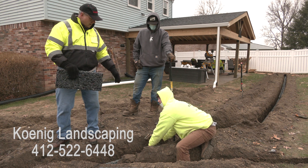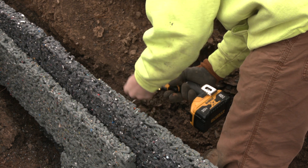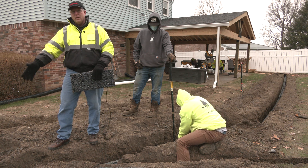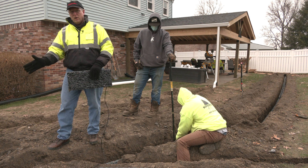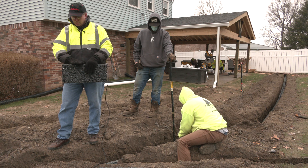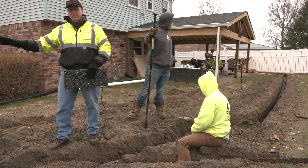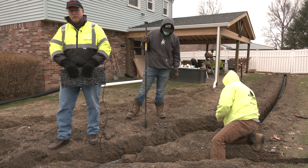Thank you, Dustin, for allowing us on your job. They're putting the boards together, and along with it they're taking stainless steel decking screws to hold the boards together. Then we're going to be backfilling the entire system with good topsoil — no clay, no shale. You want good topsoil so the water penetrates and gets into the boards, and then by water pressure it's going to move from board to board until we discharge it. Everything is flowing into our stormwater boxes so we're not discharging onto the streets.